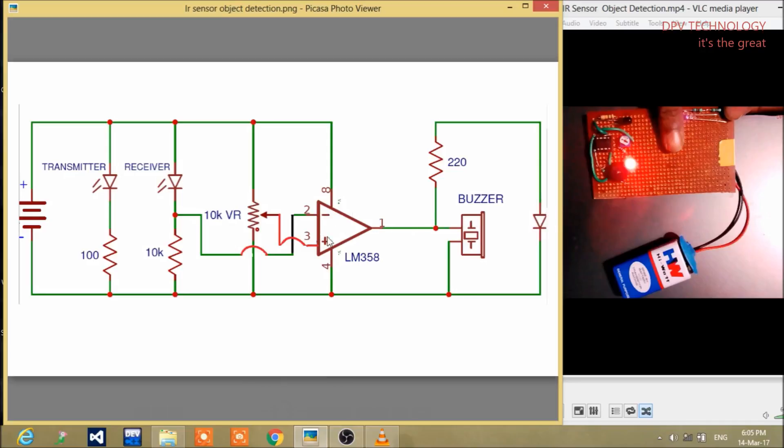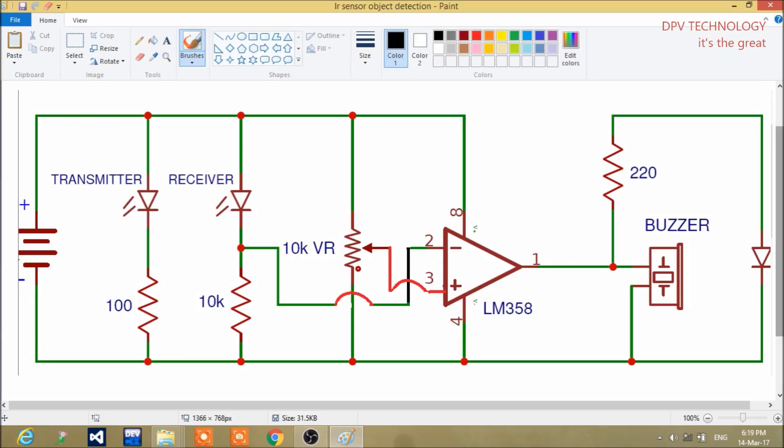Now the main component of this circuit is the op-amp. In this circuit the op-amp is connected in open loop configuration — that is, there is no feedback between output and input. If we have a connection between the output and any one of the two inputs, pin two or three, then it is called a closed loop connection, or we say it has feedback. In this circuit we do not have such feedback, so it is called open loop connection.